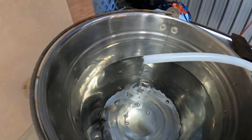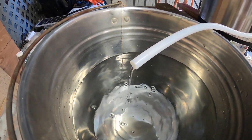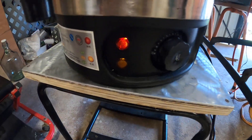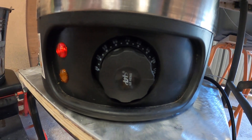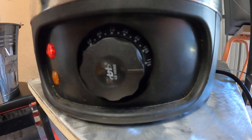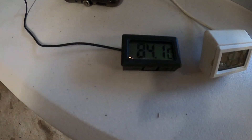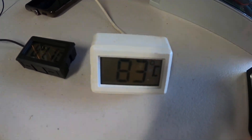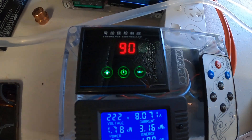As you can see it's got a steady little stream there — just a nice steady stream. The element stays on and I've got the thermostat set at 110 degrees Celsius. The water temperature coming out of the reflux is currently reading 84 degrees, and the temperature at the top of the still is reading 83 degrees. At the moment I'm just running it at 90 percent power.